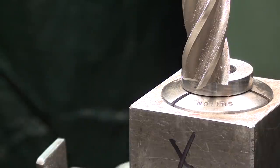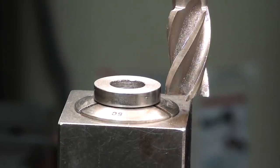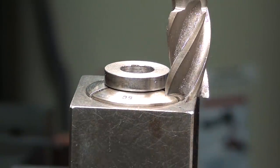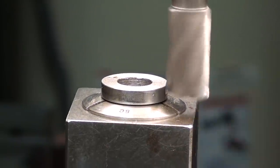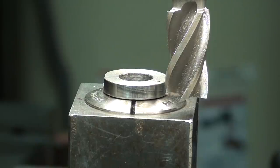Touch off and lock the quill. Raise the table 115 thousandths — I have zeroed out the knee collar. Looking at it from this direction, I'm going to touch off without the spindle revolving, and this will be close enough. I'll take an initial cut of 20 thousandths, and I'm looking at the digital readout in the Y-axis. Notice that I have rotated the entire collet block, and I'll take a cut now on the other side.